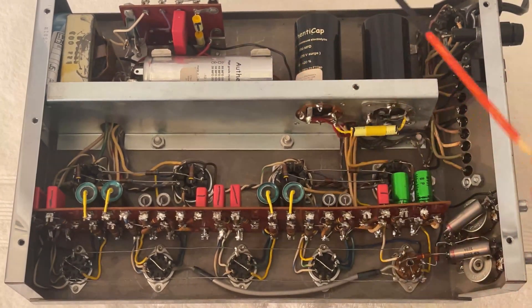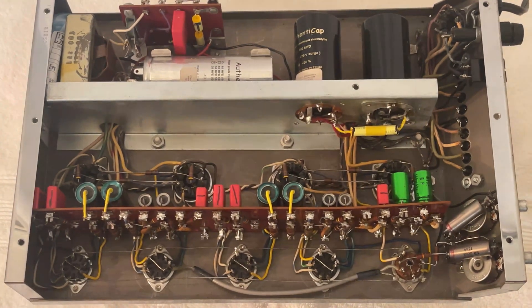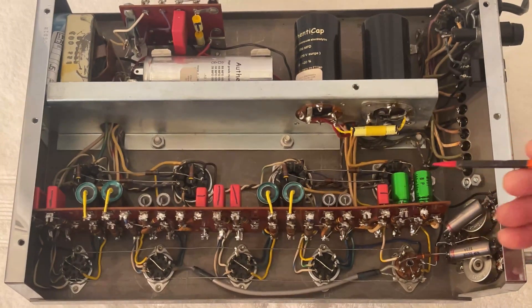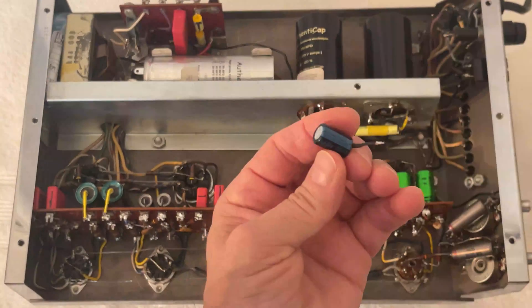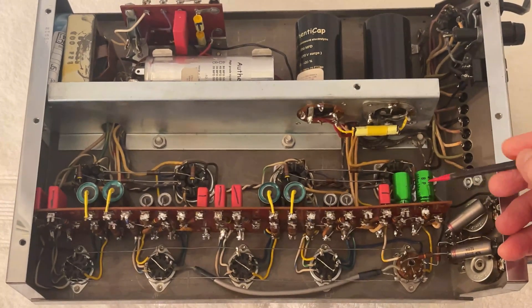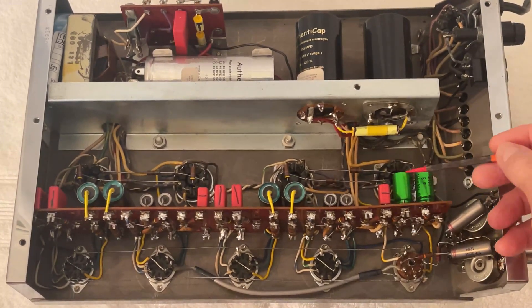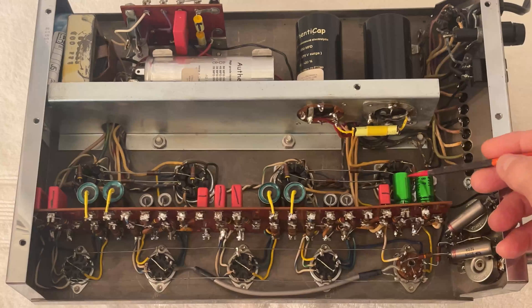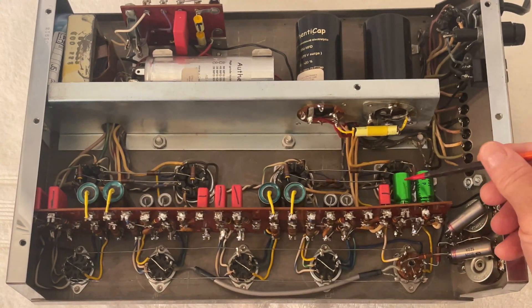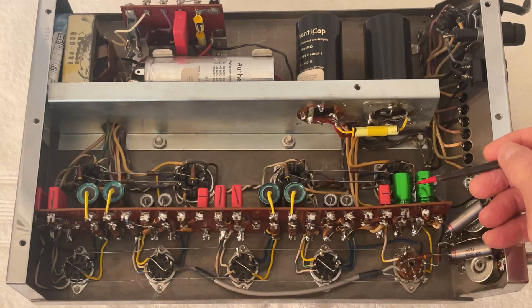Now, these were okay and I left them as they are. However, there were a couple of capacitors that I did not approve of and I replaced. The previous person had used Jamicons, so I went ahead and replaced them with Nichicon audio bipolar capacitors. These capacitors are excellent. They are very transparent sounding, very musical, and they have a dramatic impact on the way that the amplifier sounds.